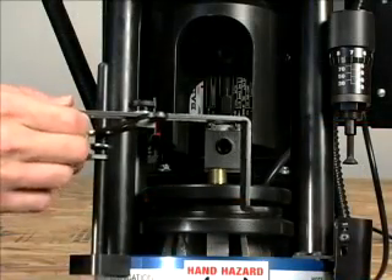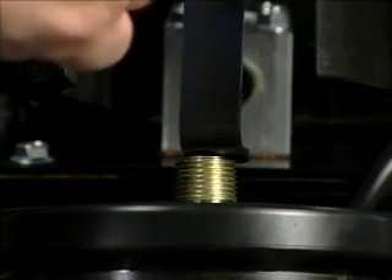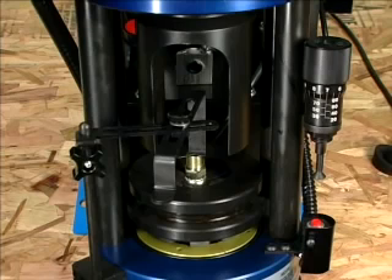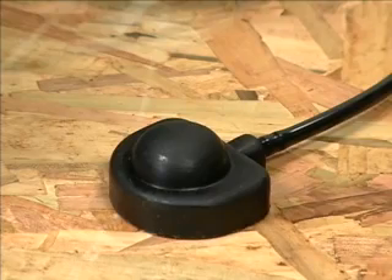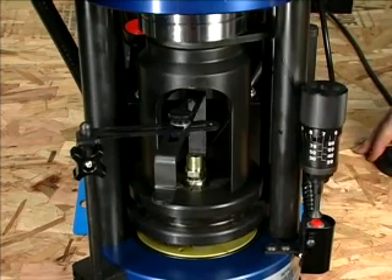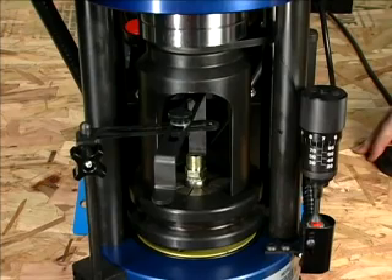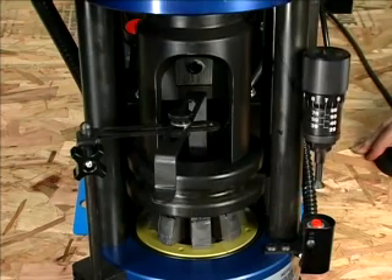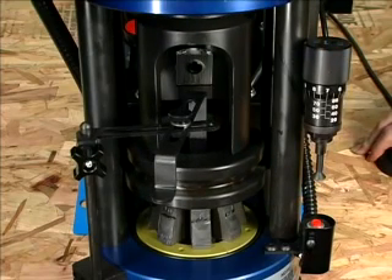If you're using the coupling stop, it can now be set to the point where it just touches the coupling — this facilitates repeated crimping of identical assemblies. Everything is now ready to start the crimping process. The alignment should look like this, with the dies level and the seams straight, to ensure proper crimping. Start the pump using the pneumatic switch. The ram will come down, make contact with the pusher plate, continue through its cycle, and crimp the assembly. The machine will stop automatically. As the ram retracts, magnets in the pusher will lift the compression ring, releasing the hose but still allowing the compression ring to align correctly for the next crimping operation.